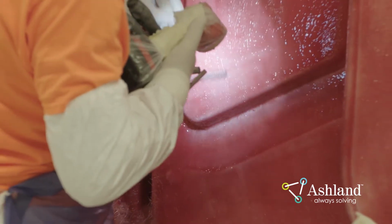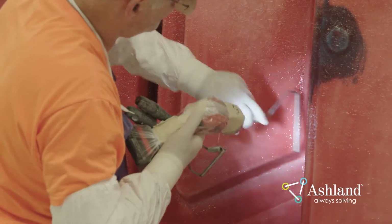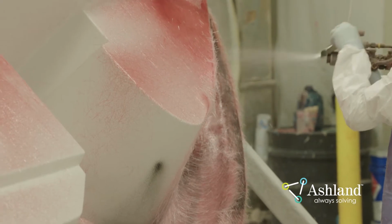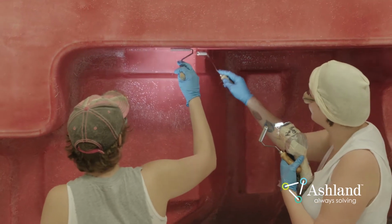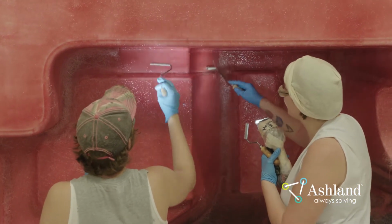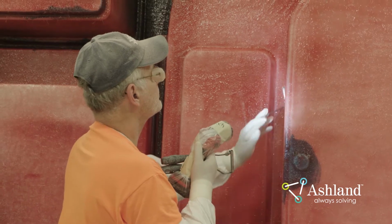Laminates that are too thick are difficult to roll out, which can lead to air voids. These air voids can cause weak points in the laminate and can lead to excessive and time-consuming rework. Thick laminates may also cause fiber print issues on the part. Skin coats that are too thin will not develop Barcol hardness properly and may allow the bulk laminates to print through the skin coat. With a thin skin coat, fibers may be difficult to roll out around edges and corners.